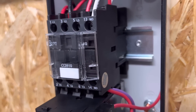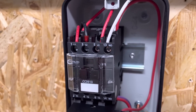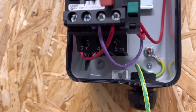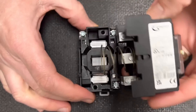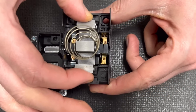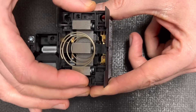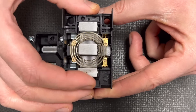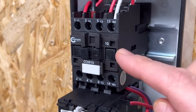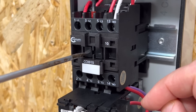Let's focus on the contactor. This is the part of the control that actually does the switching — the bit that connects and disconnects the motor. The supply conductors come in one side, usually the top in a DOL starter, and the other side connects to the load via the overload strapped on the bottom. Inside are the contacts that do the making and breaking of the circuit, and unlike a simple light switch, the conducting bar that goes from one terminal to the other actually disconnects at both ends of the device. This allows a bigger gap between the terminals when it disconnects, making it harder for the current to jump the gap when switching the motor off. You can operate the contactor by pushing in on the front of it, which makes the connections inside and allows the machine to run — however this is more for testing and maintenance purposes when the power is switched off.